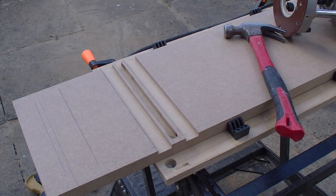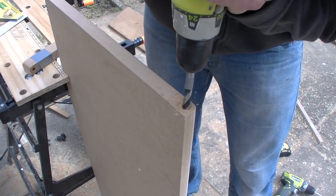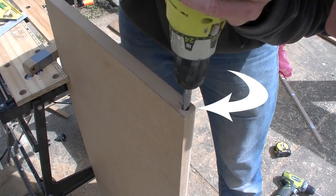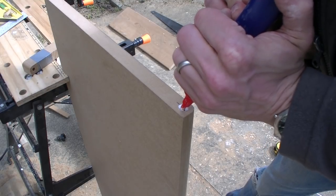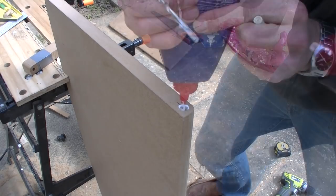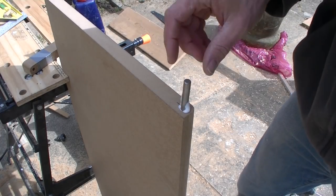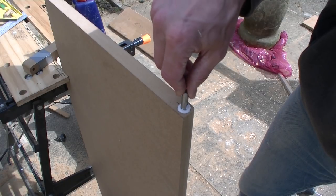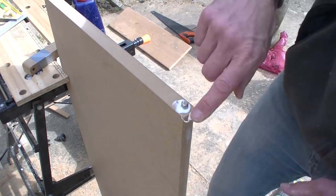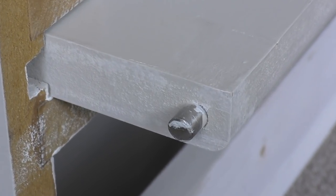Here you see the two side channels that I also created for the horizontal supporting pieces. For the pin going into the side of the desk itself, I drilled a 10mm diameter hole in the edge of the desk. The other thing that's quite crucial — you'll see there's a bevel going down the length of the desk, which you need to enable the desk to pivot in and out of the space. I put loads of glue into the hole because MDF is notoriously brittle stuff. The pin came from a swing arm towel rail — a 1970s swing arm towel rail that we found in the airing cupboard when we were ripping out the bathroom. It just became the most fantastic thing to use for this, and you can see the glue squidging out. I wanted to get as good a joint as possible and the glue really helped to stop the MDF from splitting. Two years on there is no sign whatsoever of any splitting on the wood, so the glue has really done its job.